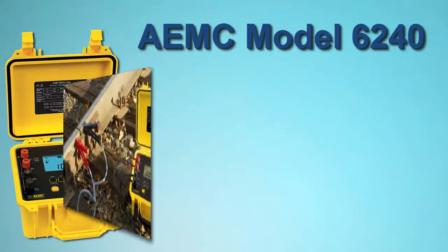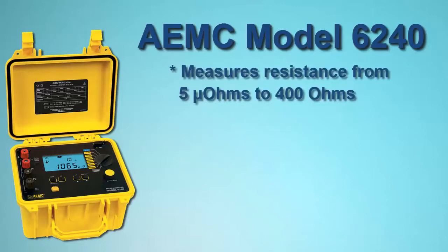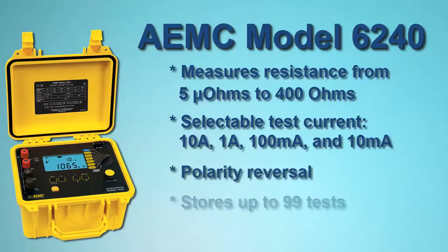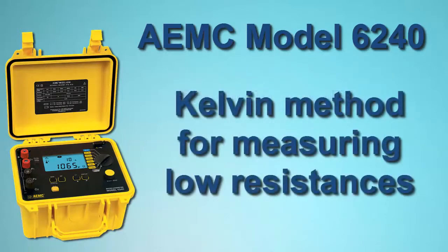The Model 6240 measures resistance from 5 micro-ohms to 400 ohms. The instrument provides selectable test currents of 10 amps, 1 amp, 100 milliamps, and 10 milliamps, and includes a polarity reversal function. Up to 99 measurements can be stored in memory. The Model 6240 employs the Kelvin testing method to measure very low resistances to within 0.25% accuracy.